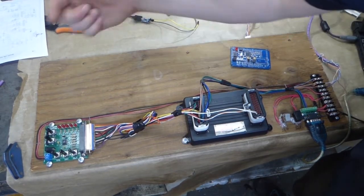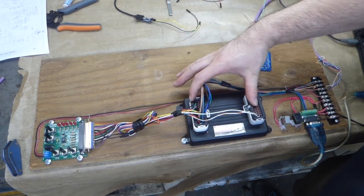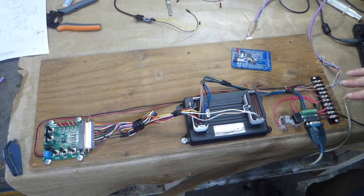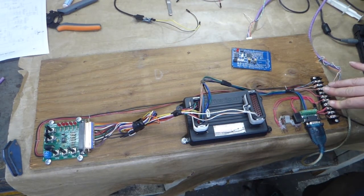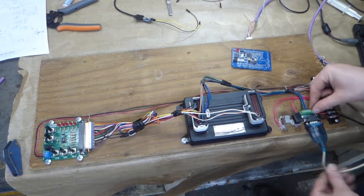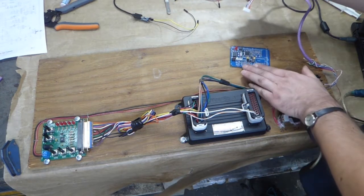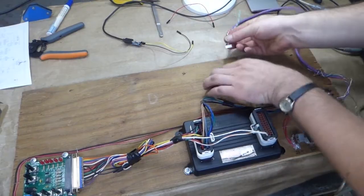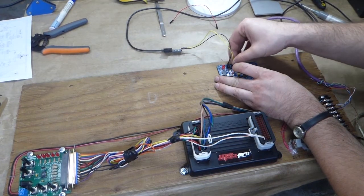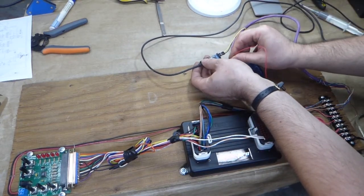It basically just consists of an old Megasquirt stimulator connected to an adapter harness that allows it to plug into the MS3 Pro, a little bit of wiring to break out the CAN bus connections, as well as supply 12 volts via terminal strip, 2 switches, one to turn on the master 12 volts, another to turn on the ECU, and finally a serial port interface so I can connect it to a computer and Megatune. There's also a short wire harness which will connect to the controller board. Now this is just a serial port so I can view the output of the test code.